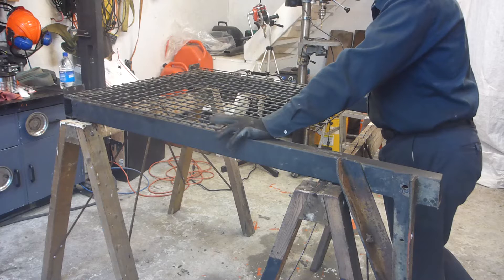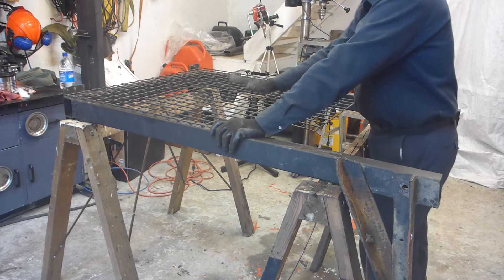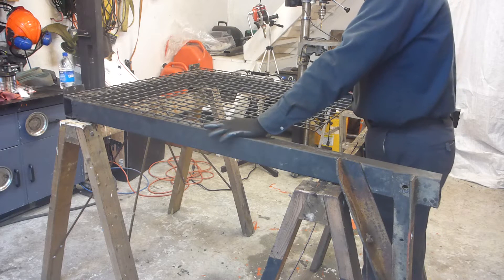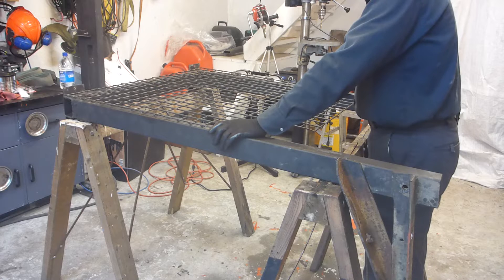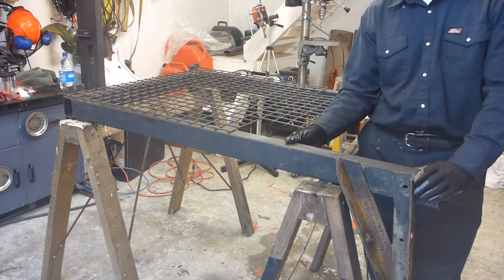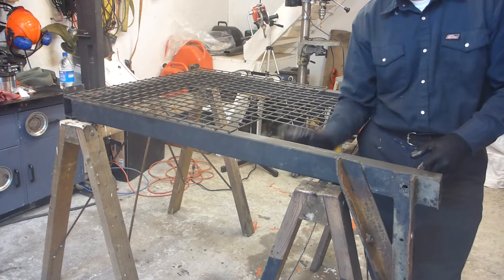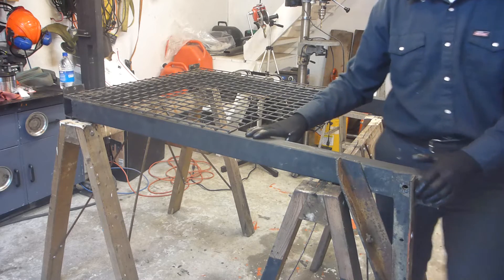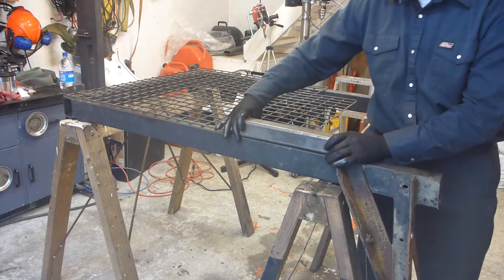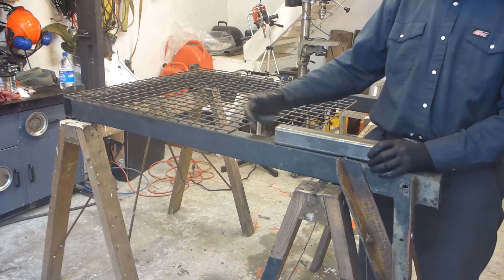This is the back of the ROPS. This is where I put the grill — it's protection against any rope or chain that might break, so it protects me. The system to attach this was a pain to install. I'm going to weld some nuts so I can put this on quickly, and I'm going to add some reinforcement in that section. I couldn't reinforce at the front because of the fenders, but here along the length I can reinforce. I'm going to put some 2x2 tube, grind these welds, make sure the tube fits, and fit the ends at an angle to close the opening.